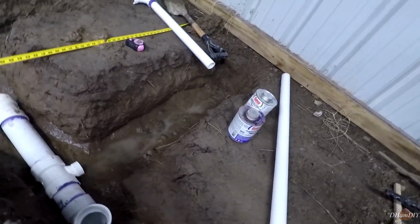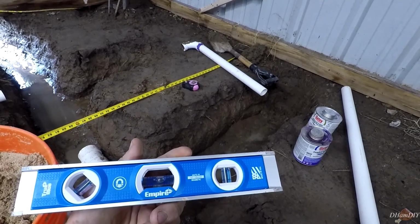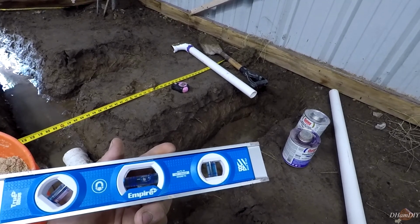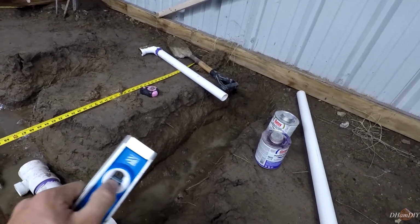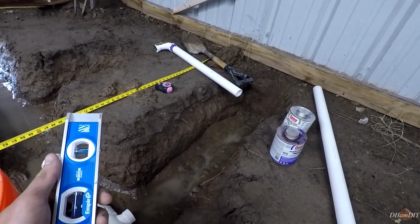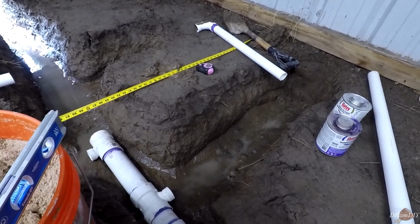And on top of that, there's certain levels that will have different markings. You see here, where instead of just having a traditional 2 lines, there's actually 6. And that first line is going to be an 1/8 of an inch slope, and then the second line is going to be a 1/4 of an inch slope. And then subsequently, if you want to do a 1/2 inch or something, you can kind of tilt it a little bit past that. But yes, I've been making sure the slope's about maybe a 1/4 of an inch per foot, or a little bit more of a slope than that, right? Hoping that if things settle and try to get out of whack, then we won't have any problems like that.